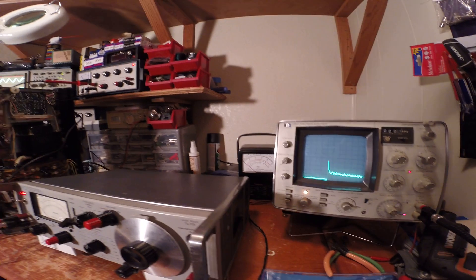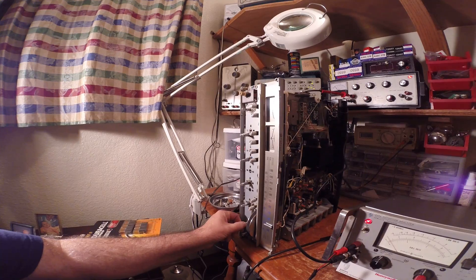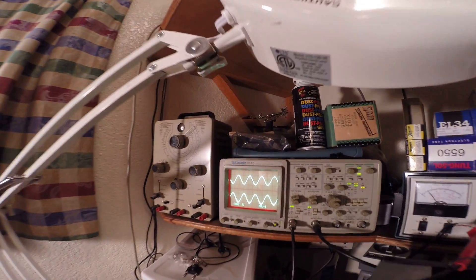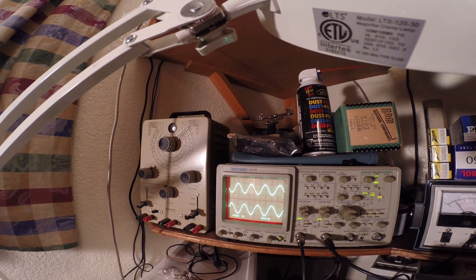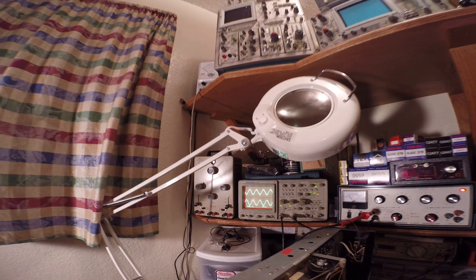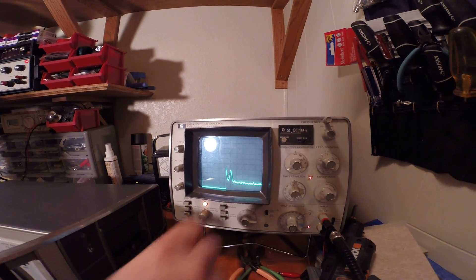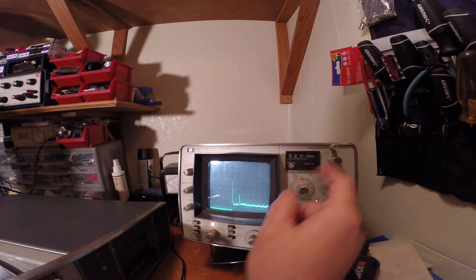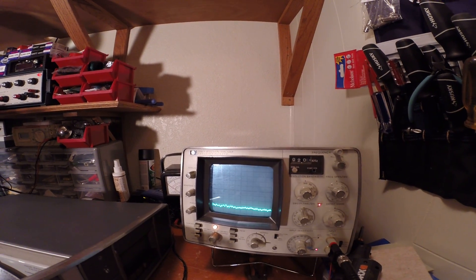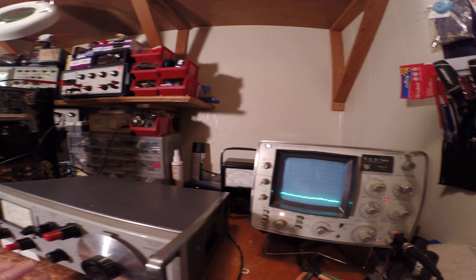The very first thing we're going to do is bring up the output. If you look at the oscilloscope, we'll bring the output up to 5 volts peak, and at 5 volts peak it's 1.6 watts. Now if you take a look over at the spectrum analyzer, you'll see that the fundamental frequency is 2 kilohertz — you can see the hump there at 2 kilohertz. We're going to be looking for harmonics, so I'm going to move the trace over to the edge, and if anything pops up that's not the fundamental frequency, we'll find out.